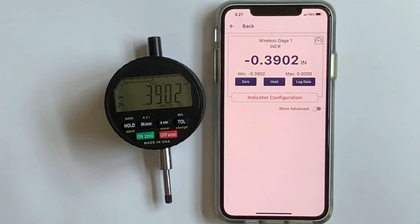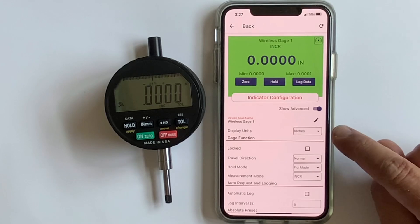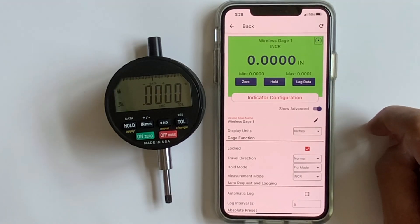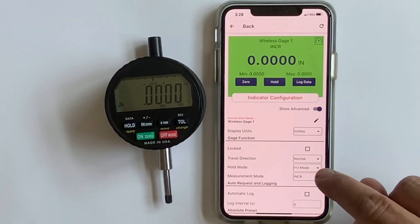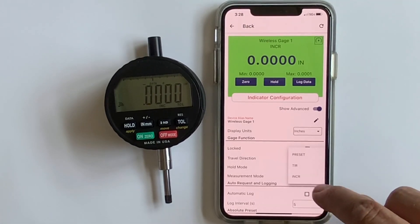Under the 'Show Advanced Features' bar — which is a setup menu you'd configure and then close before returning to the main screen — you can change units from inch to metric (inch to millimeters). You can lock the gauge by checking the box; the indicator lock comes on the display and if you try to change anything the lock blinks. You can change direction, and set freeze options: freeze min, freeze max, hold max, hold min — freeze max is usually the standard.